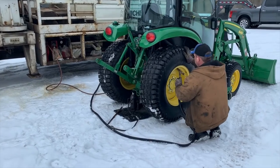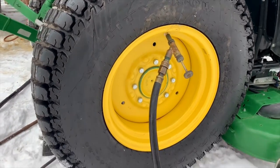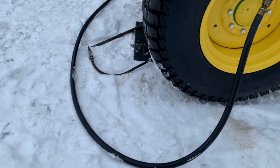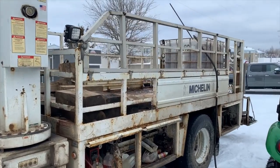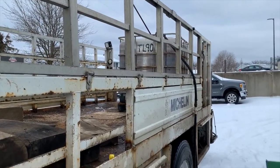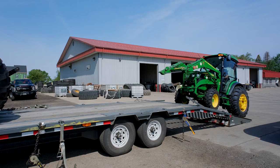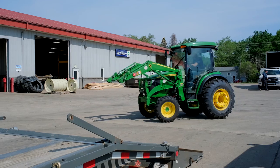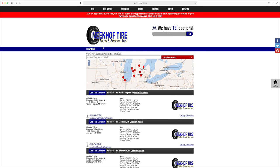Liquid ballast is something I use in every tractor I keep personally — except for my new 1025R that we just got, though I will be doing it soon. It's such a valuable amount of weight to have hidden right inside your tires. You get questions about whether it'll impact mowing your lawn — yes, it adds some weight, but that weight is spread across the contact surface of your tires, so it increases PSI but not a whole lot. We use a local industrial tire shop called Meekhoff Tire, and they just loaded our new Kubota M4 tractor with about 1,700 pounds of liquid ballast in the rear tires.